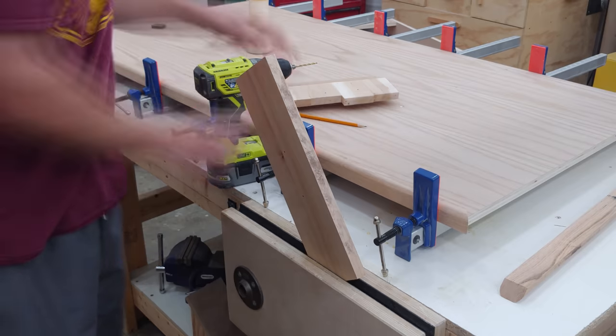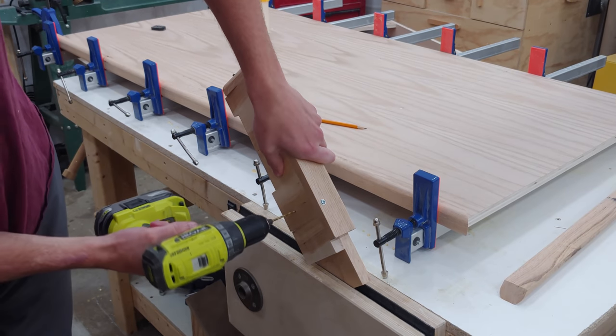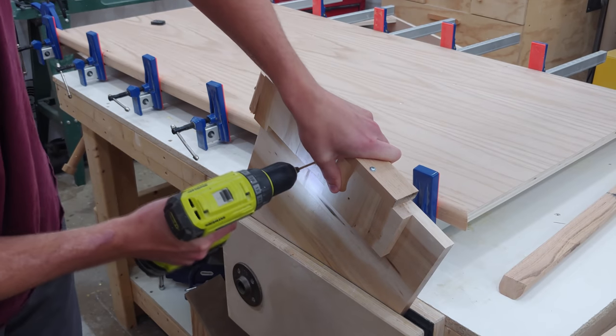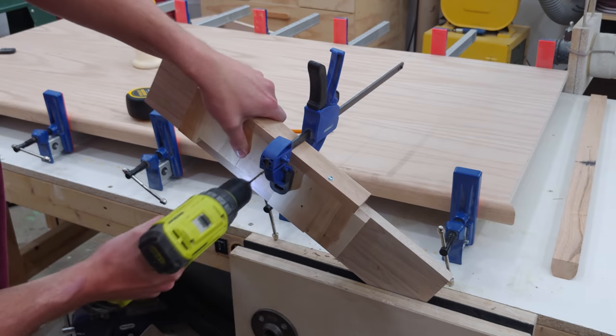To attach the drawer fronts and handles, I create a right angle jig with two holes spaced 3 inches apart in the center to rest on the drawer fronts for easy drilling of the holes. The same jig is used for the large file drawers as well as the wide center drawer, with the exception of the one edge removed and manually aligning the center mark.